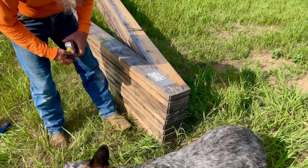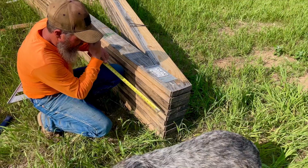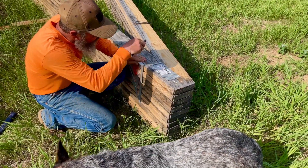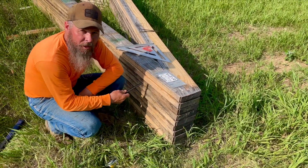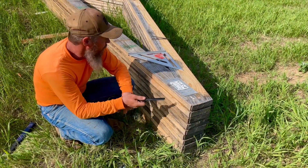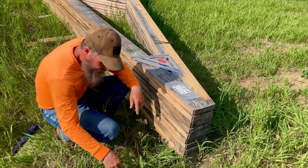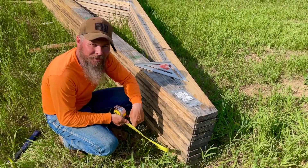We're going to mark these all at one time. The overhang is at 12 inches. We can get three of them — they weigh about 350 pounds each. So let's just do a few at a time and mark them so we don't have to do it up on a ladder. When we're setting the trusses, we just look at that line and bam, we're done. Mark both sides. By getting them in line down here, we do it all just one time instead of up in the air.